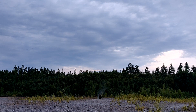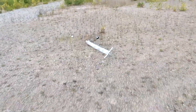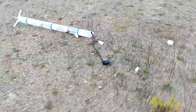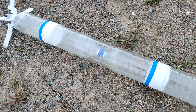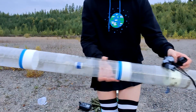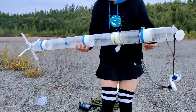And of course it did fail. At least the parachute deployed, but the nose cone is in a hundred pieces. Rest in pieces, I guess. It was leaking somewhere in the fairing section, so I could only launch it at 5 bars, which explains why it was unstable. The rest of the rocket was pretty much intact except for the nose. I think I'll end this project here and head back home.